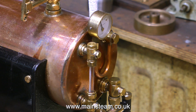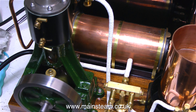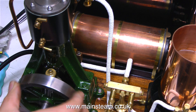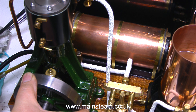I've overdone the injecting, and as you can see the gauge glass is completely full, and the pressure inside the boiler is low. I've fitted a Bix gas burner to this boiler, and the sudden change of note of the burner tells me that the gas is now burning underneath the ceramic and cremating it. It's very common with Bix burners if they're not set up properly. But this one is set up properly, and it's been running quite happily for the last couple of hours. Then suddenly it makes a funny noise and starts cremating the ceramic, accompanied by a white residue underneath the boiler. I will look into this — I'll contact Phil at Forest Classics where I bought the Bix burner from, and I think I'll make a video about setting up Bix burners.